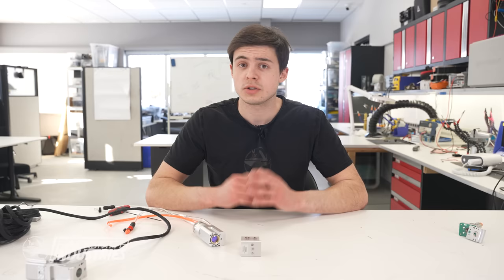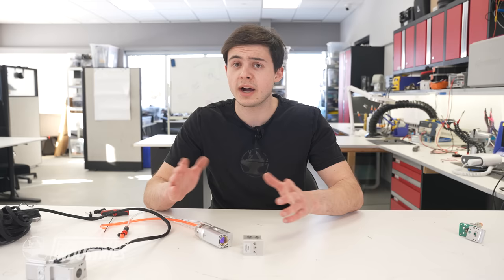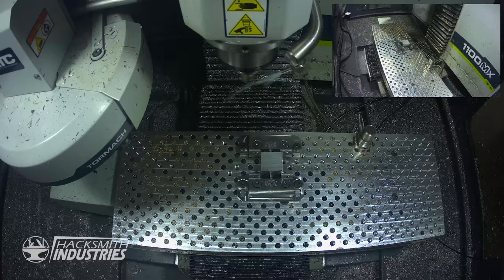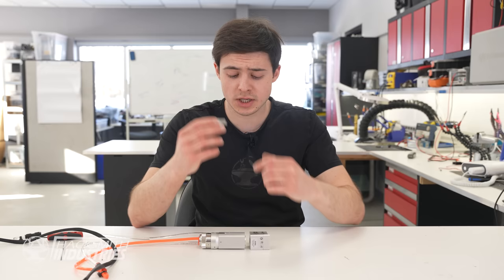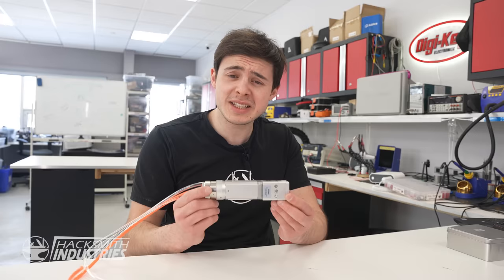Since I've designed a custom fancier nozzle, what we're left with is simply the water-cooled collimating lens and the focusing lens. I needed to create a piece to join the two together at the right distance with perfect alignment. After prototyping, I came up with a design we could manufacture in aluminum on our Tormach 1100 CNC machine. This is the smallest 1,500-watt fiber optics lens assembly I've ever seen — perfect for our Iron Man laser gauntlet.